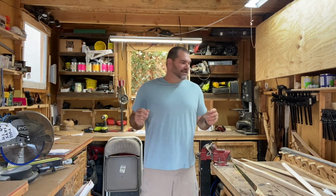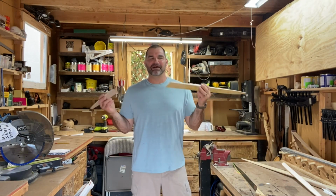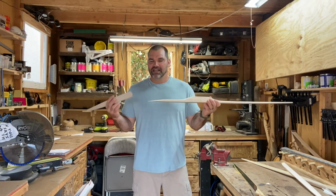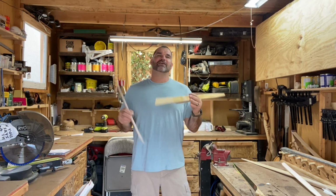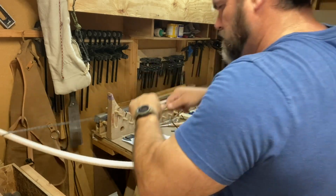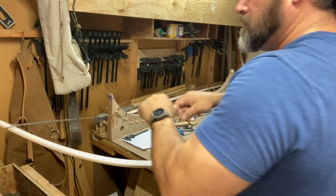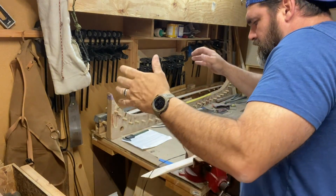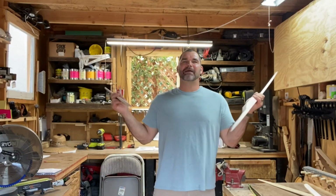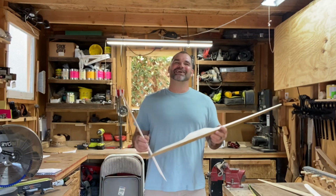Hey, this summer I've worked on a few projects other than trying to re-strengthen and get back to whatever normal is for my knee, and worked on a couple maple board bow builds that didn't come out so well. This one was 72 inches long and it broke because of some limb twists that I was trying to correct. Check this out. Snap right in my face. So I don't recommend tillering like a gorilla. Tiller more like a butterfly.